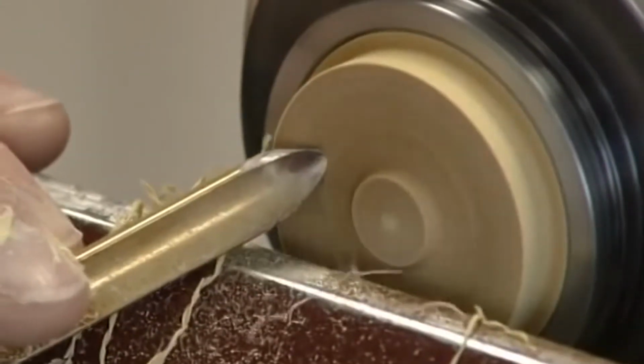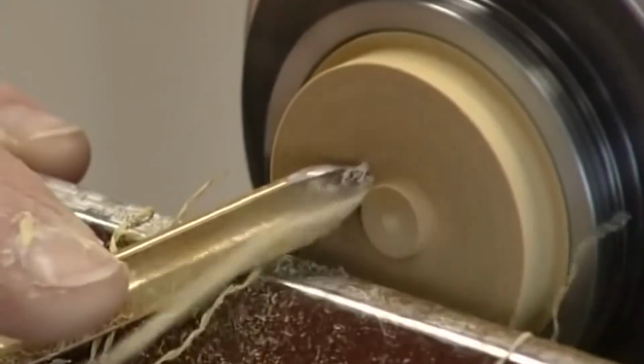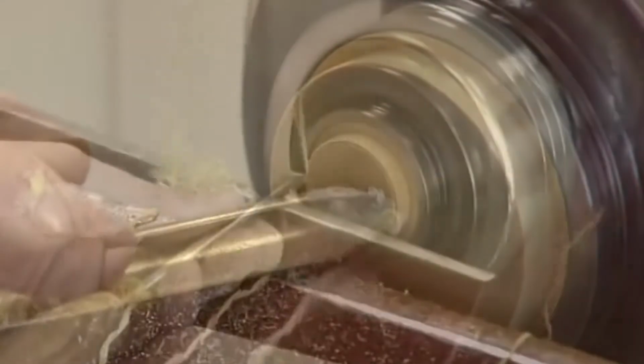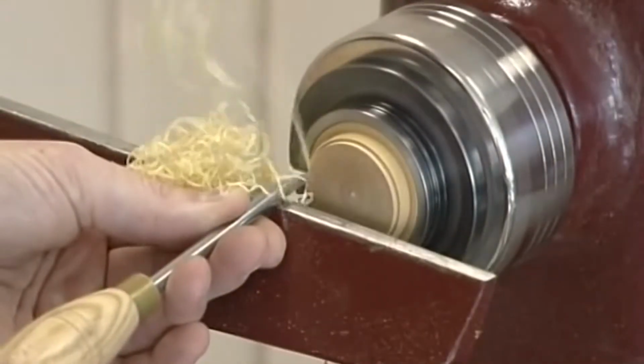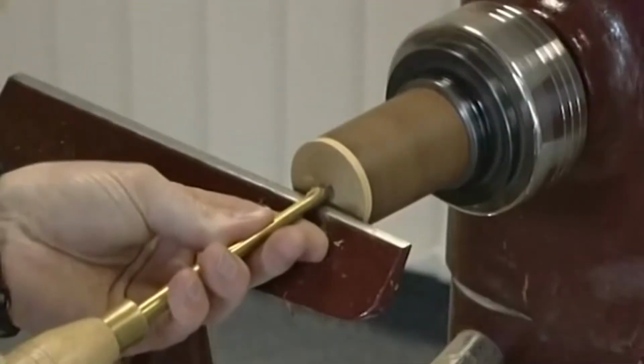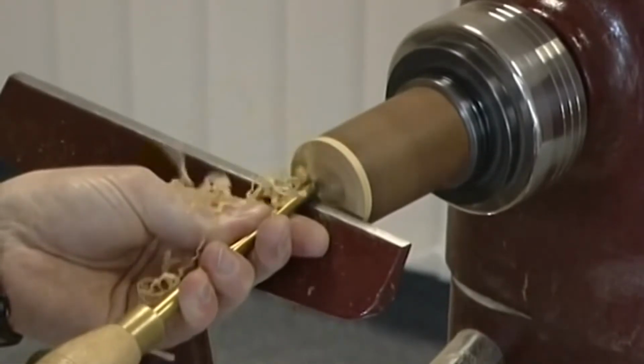After hollowing, mount the spare boxwood section on your lathe and cut a spigot the same size as the hollow in the base. The two should fit perfectly. Finally, trim the shoulder. Fit and then glue the two sections together. When the glue has set, hollow the boxwood in preparation to create the internal thread.